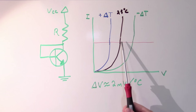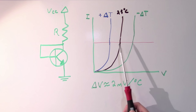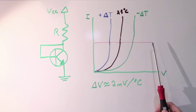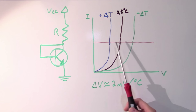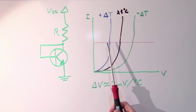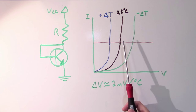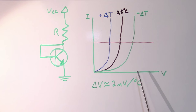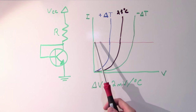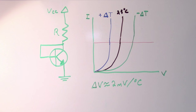This is a common plot of current versus voltage for a diode — one curve done at 25°C. If we hold the current constant using a constant current source or sink, as temperature changes this graph shifts. A positive temperature change shifts the graph to the left, meaning the voltage across the PN junction drops. If temperature decreases, the graph shifts to the right and the voltage increases. As long as we hold the current constant, that change in voltage over temperature is actually quite linear — typically specified as approximately 2 millivolts per degree Celsius.